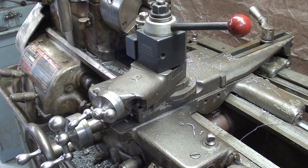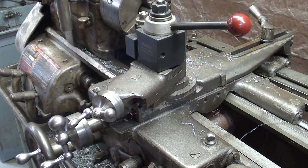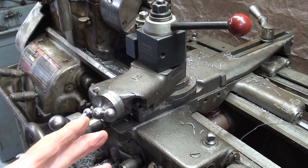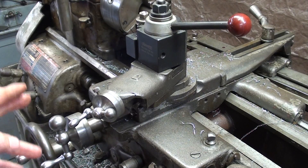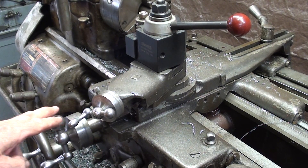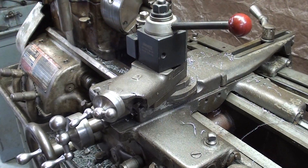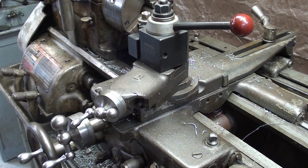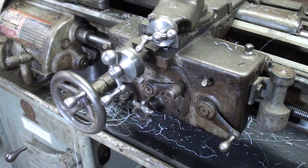With a telescoping taper attachment, you can do your depth of cut feeding either with the cross feed or the compound. Right now the compound is set at an angle, so it wouldn't work at that angle — but if you want to use the cross feed, you will have to unclamp the binding screw, make your adjustment, and then reclamp it. Another advantage of this taper attachment is that we can use the power feed using the clutch on the South Bend lathe — you cannot use the power feed with the compound rest method; that's strictly hand-fed.